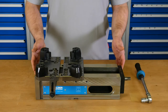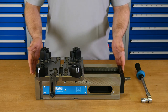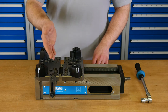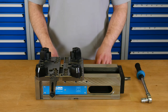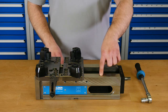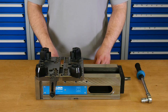Here you see our multi-vice with jaws and grippers for grip clamping. The vise consists of a base body, which is available in three sizes, and changeable jaws. If necessary we can mount a workpiece stop on the side. The jaw in the back is always fixed in position. The jaw in the front is connected to the spindle and movable. We always have to differentiate between fixed and movable jaws because the fixed jaws will be mounted on the guideway of the base body and the movable jaws will be mounted on the spindle.